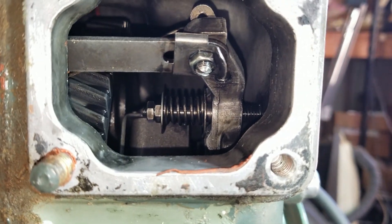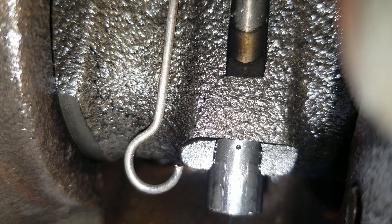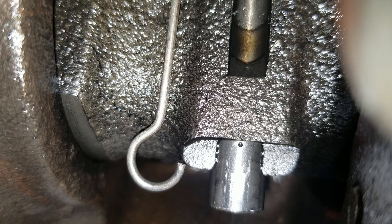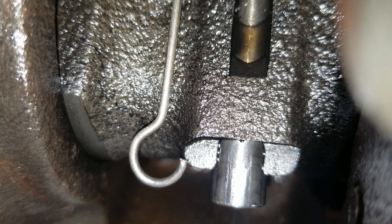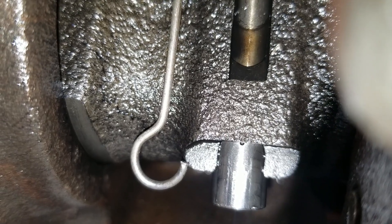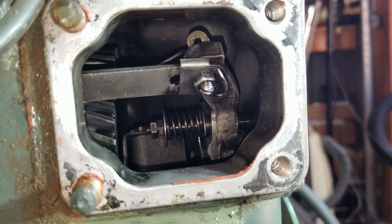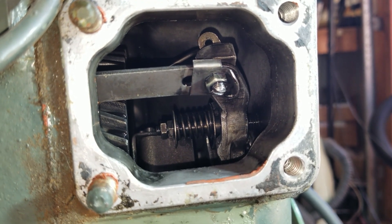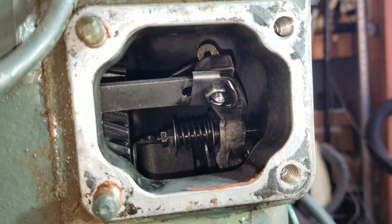Let's check the dot. Alright, so the dot's not on there yet. I'm adjusting the screw — adjusting the screw out. And you'll see it's going to get right there. Split it. That's it. Right there — split. See? It's barely touching on there and it's splitting the line. It's not compressing it, just touching the surface of that spring down in here. And it's good.